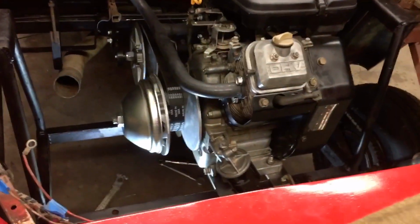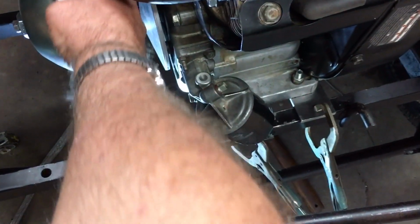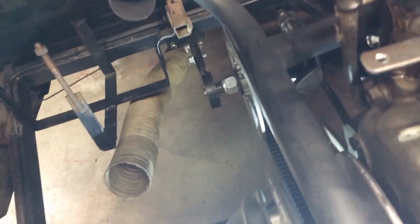But a Comet clutch is easier to go. I normally cram it down in that groove, in that cavity, and let it lay right over the center of this clutch, right in between, wherever it will line up in the middle. And of course then you can set for straight too. You can take this and lay it like so, and make sure that you're running straight on your belt with the sheave. You can lay on the side of the sheave back here and make sure that you're running straight up here.